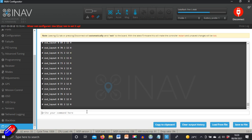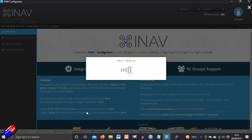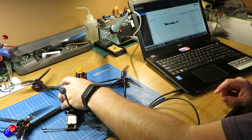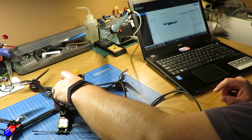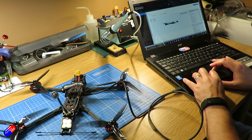One thing I noticed: there's a save command at the end of the dump file. Unfortunately, that means it saves before you get a chance to review any errors. I did get a couple because this dump file is from a previous version of iNav and a couple of things have changed. That said, it gives you a firm foundation, but if you took it to the field right now and tried the GPS stuff, it would be a disaster.